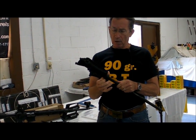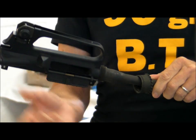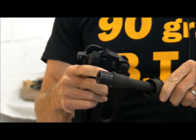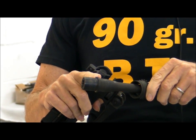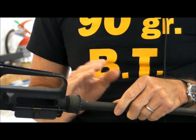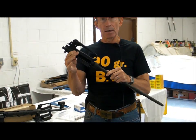The barrel nut holds the barrel onto the receiver. The barrel slip fits into the receiver, and you can see there's a lot of play left in that. The barrel nut goes on and presses this raised flange attached to the barrel extension. This portion from the flange back is not part of the barrel — it's a separate part. When you assemble one of these, you slide the two together, screw the barrel nut on, and that presses against the flange and locks the barrel front to back in the receiver. But it doesn't correct movement up and down and left to right.